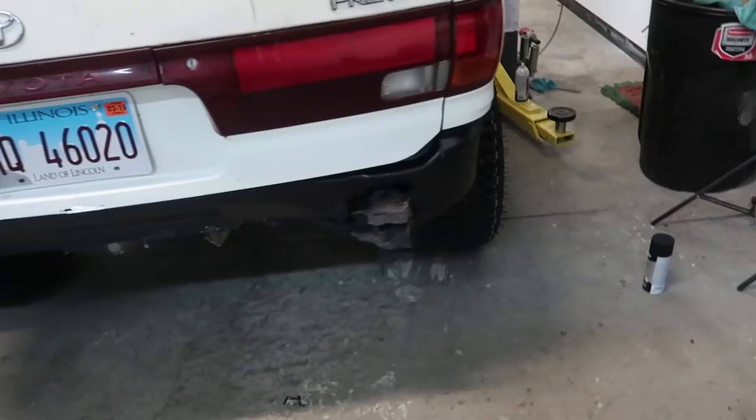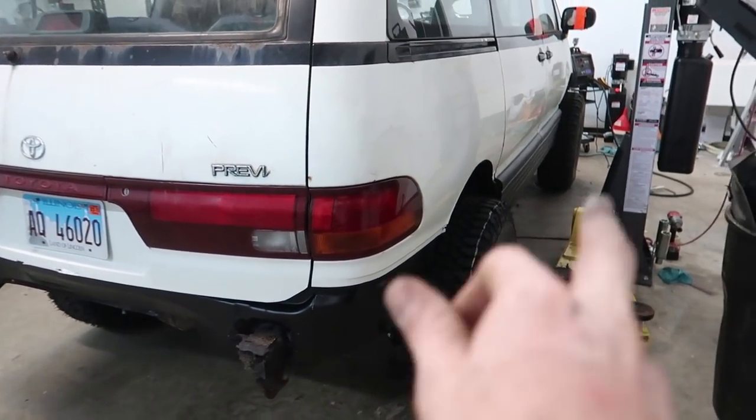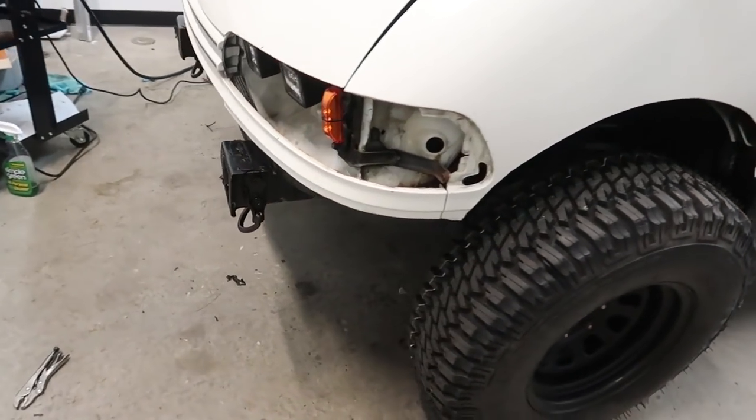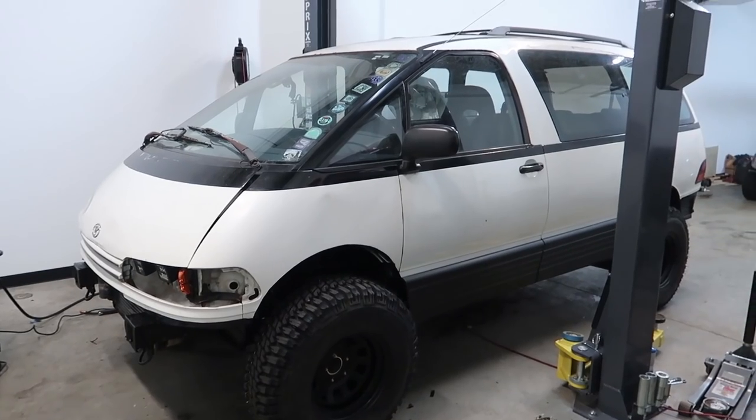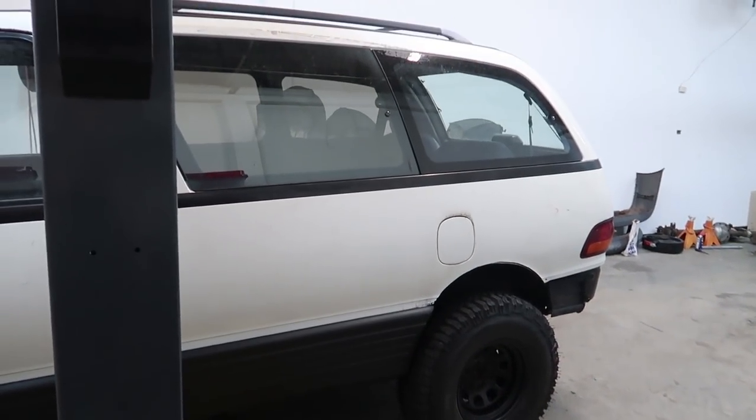Still have some mad positive camber, but yeah. I went ahead and painted the lower section where the bumper covered up to match the side, did the same with the front — painted that area so it looks nice. It really does look cool. I just wish it would drive. I mean, it does look so sick. I'm very torn on this thing. If I sold it as-is I could get $1,500 for it. But that's not what this video is about. So there we go — that is the easiest and sketchiest way to lift a car. We got an extra two inches of ground clearance for nine dollars. That's how much that steel costs. Everything is solid, everything is sturdy. All you need is some square tubing, an angle grinder, and a welder — and there you go, you can lift any car with a coil spring.